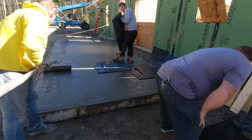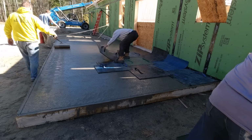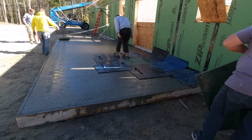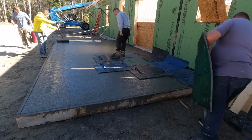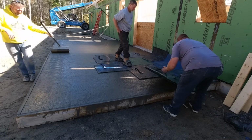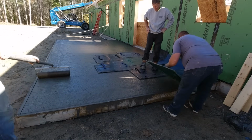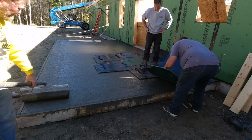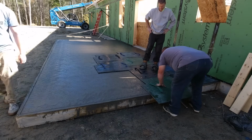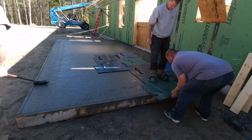This is basically a set of these Ashlar Slate stamps. You get 11 in a set. You get 9 of these rigid ones, which I'm putting down right now. I'll have a place you can check these out, so you can go buy some if you want. And then you get 2 what we call floppies. You can see there's a blue one and a black one over there to the right that kind of flex up the wall. Those are called floppies. Those are a lot thinner than these rigid ones, and they flex a lot easier to go up walls like that, or maybe to go up around a post or a column.